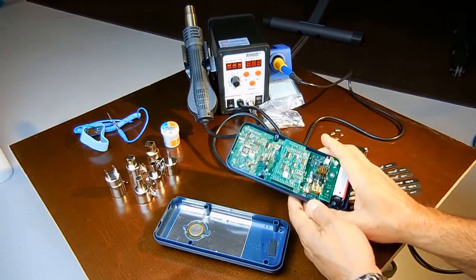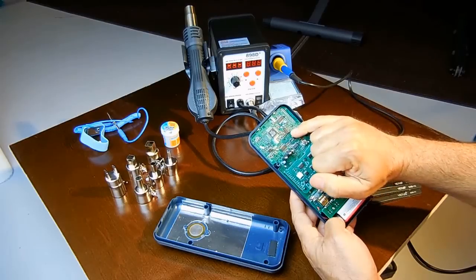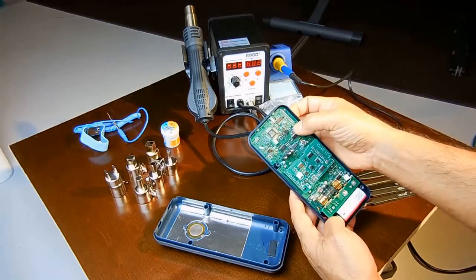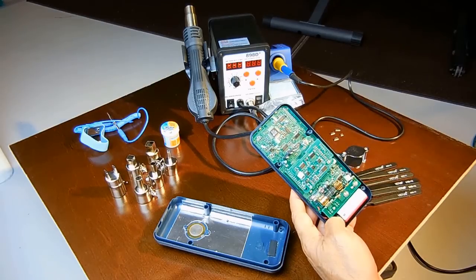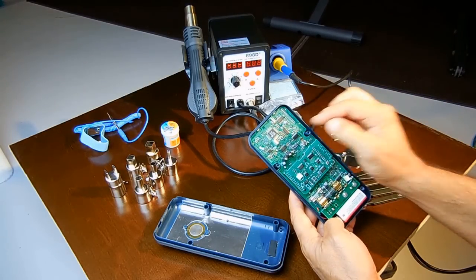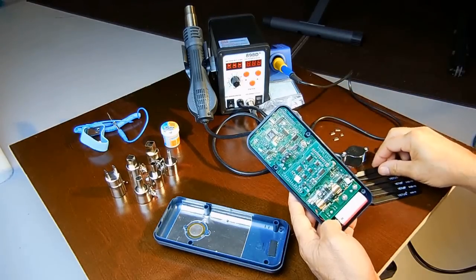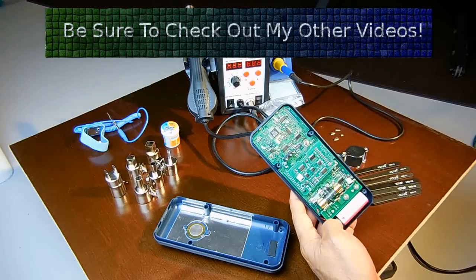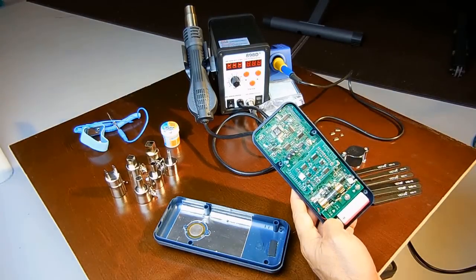Now, to get started — a while back I ended up damaging my good tester, the WaveTech 27 XT. I was testing a circuit which had high frequency and high voltage, and it was a little too high. It ended up frying one component. I traced it back and swapped that one out, which eliminated the initial problem. But I discovered another problem caused by the high voltage. That first component I did by hand: I took very small cutters, cut away all the leads one by one, took tweezers, lifted it off the board, and then using a soldering iron I desoldered all the leads, cleaned all the pads, applied flux with my flux pen, positioned the IC, and soldered it back in.